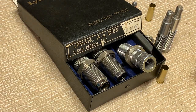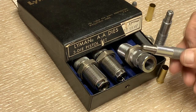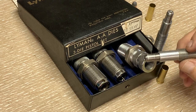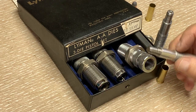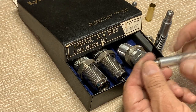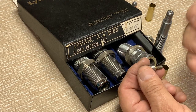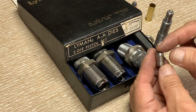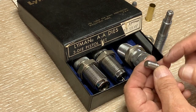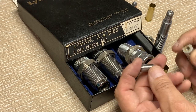But I had a problem with the actual component. The expander die did not work according to what I had planned and was not to standard for what I needed to do. The pilot and the expander together, which are immovable on this aluminum stud they provided, really is only for .38 caliber. It's not made with the intention of expanding the case enough to seat the .361 bullet in it.